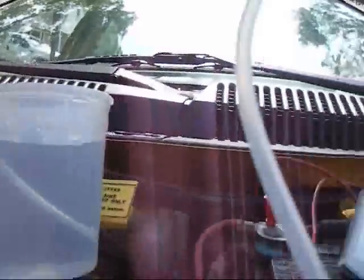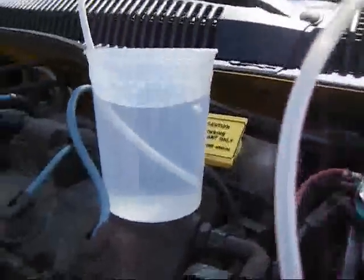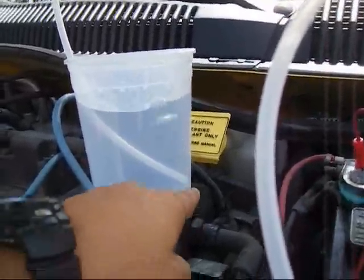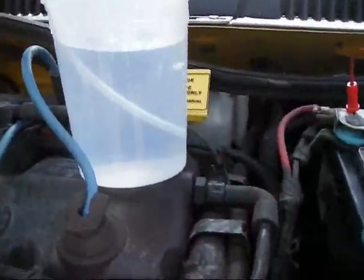And this is our production. Yesterday I hooked it up with a massive amount of electrolyte in there and it maxed out the meter — it was pulling over 25 amperes, but it was also probably generating near 3 to 4 liters a minute. There was just a steady stream of bubbles. If I lit one, it probably would have flashed back into the whole thing. So yeah, there's dismal production, as always, at 5 amps.